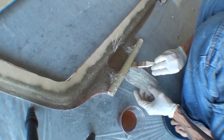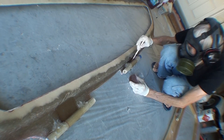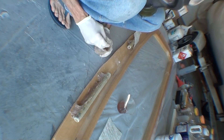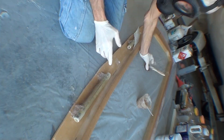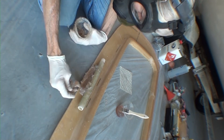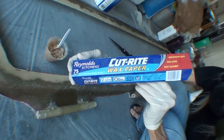Since those pieces were only tacked in place, I'm going to go through now and attach them more solidly to the window frame and the other piece that gets glued to the boat. The first stage involves some chopped strand mat that gets wrapped around and glued down. Each side gets treated a little bit differently — the other one was wrapped underneath, and this one I'm putting thickened resin down first and then laying the chopped strand mat over the top.